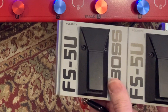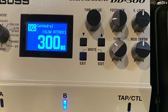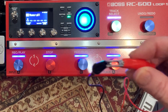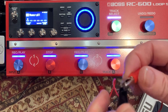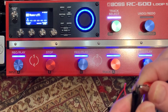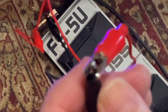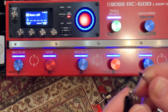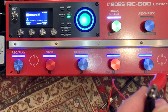One of the first things you need to know if you're going to make your own switches is whether you need normally closed or normally open switches. Now with most Boss pedals, do you need normally closed? What does that mean? Right now this is a switch hooked up here. You see nothing's happening because it's a closed circuit — it's going through. The minute you press on a switch that opens it, there's what happens. If you leave it open, it's going to scroll — the same thing as pressing and holding this one over here. You can scroll down one by one by breaking the connection, making it open. So it is a normally closed type of switch that you need.